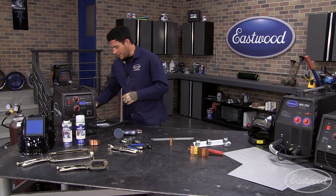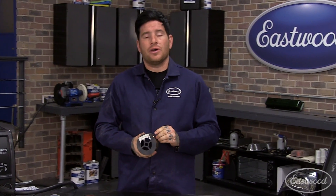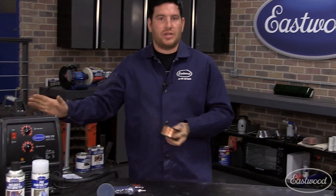With sheet metal welding, there are two wires that I would suggest to use. I would not suggest using flux core welding wire when doing sheet metal work. I know some people do it and get by, but it is not good. Flux core wire is thicker because of the flux around it, and it generally takes more heat to melt, which puts more heat into the panel, causes more warping and more grinding. I definitely suggest using MIG welding with a shielding gas.